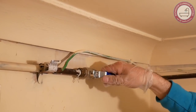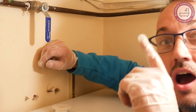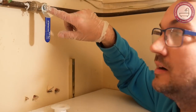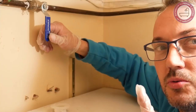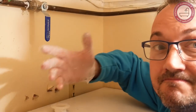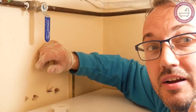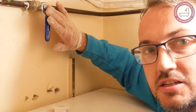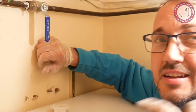That's on — now time to test it. It's a bit cosy in here; a lot of plumbing is done in very tight spaces. I went back into the corridor and turned the ceiling lever valve back on. I'm going to test this one now — the water is primed to here, and by moving this lever it should allow water to flow into the tank, just under the camera. If I stop talking we should hear it. There it is — very loud! I don't want to run it too long; the whole point is to empty the tank so I can change the pump. At least this is much better for the customer for future use if they need to isolate the whole flat.